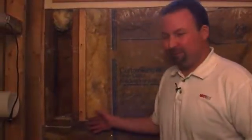We're installing an ioDIGITAL from Moen in an older model home that dates back to at least 100 years, if not older. In this particular situation, we have a short or a shallow shower that used to be an old tub and shower unit. I've only got 32 inches from back wall to your step-in sill. That tightens you up quite a bit.